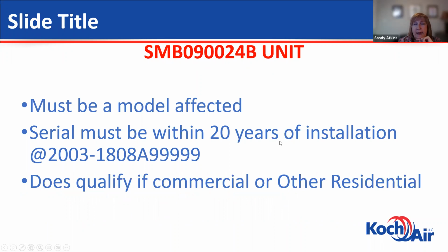The SMB 090024B is when you decide to change that unit out, and you do not have to do a specific unit. It can be any unit. It does not have to be one of the specific ones. So if somebody chooses a different unit, as long as it's within 20 years of installation, you can change it out, and it's done on Service Bench as a warranty claim. And the customer and yourself would get a $525 credit back on that warranty claim. You would charge them for the unit, for labor, and for all service materials, and then you would give them a $525 credit. Carrier puts that through as they consider that to be $325 towards the labor and $200 towards service materials. So it comes out to be a $525 credit.